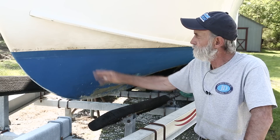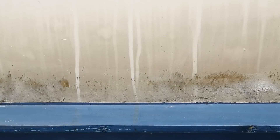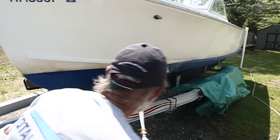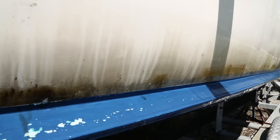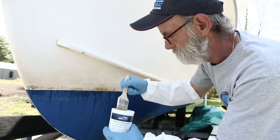But the most important thing right now is to remove this stain along the waterline. It's got a hold of the porosity in that gel coat and it really has to be taken off with an acid. You just wouldn't want to take a buffing wheel and buff it and get that stain all over the buffing wheel — you wouldn't be able to use it for the rest of the boat.